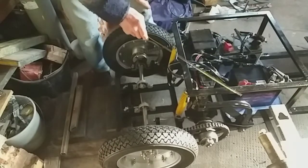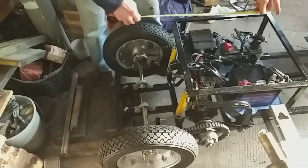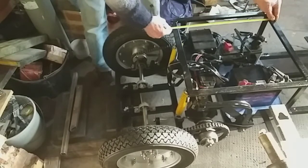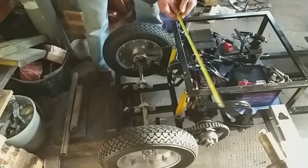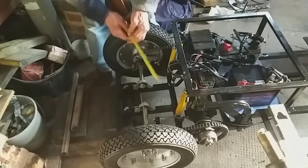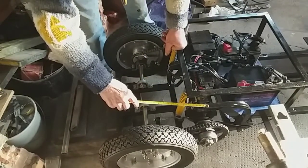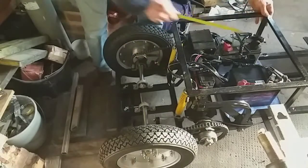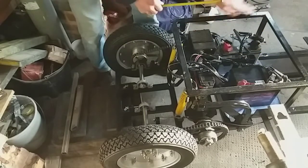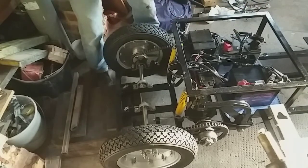On the top here, this is inch by half inch rectangular section. I've welded up a square frame - 19 by 18 and a quarter - two and a half inch, two bits two and a half inch under there. Then I've welded bits on there and made sure it's parallel with the chassis so it's running straight.